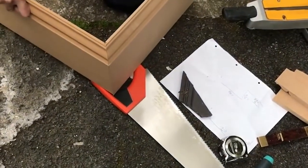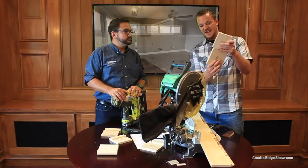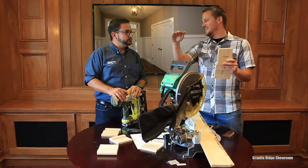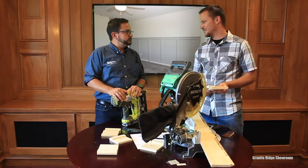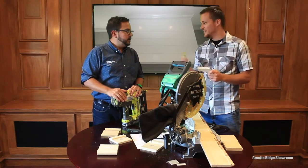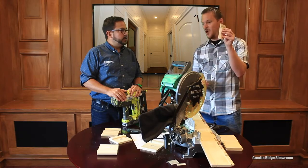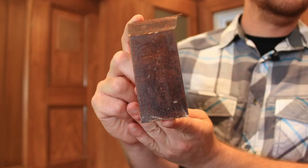Yeah. Another one would be a butt joint. Butt joint is literally just cutting 2 pieces and putting them together just like that. So 2 90-degree cuts, straight cuts, you butt them together, and that's why it's called a butt joint. So now the third one is probably the most complicated of them all. And this is one that really sets apart a good trimmer from maybe a trimmer that's not quite as seasoned, and that's called a cope cut. And a cope cut, as you can see here, it actually mimics the profile of the trim.